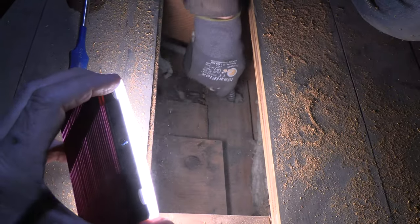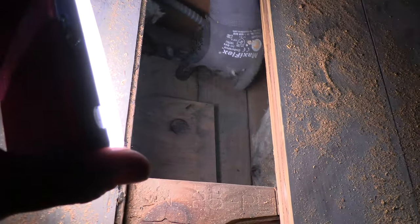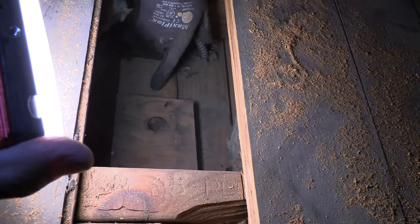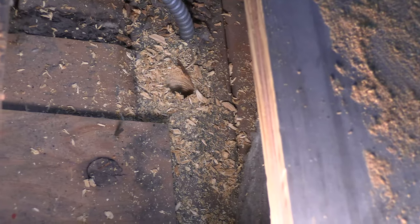Just a tad more investigation up here. I don't find any other cables, and I'm at my 70-inch mark — I think that's the cable from the receptacle we disconnected at the start of this job. I'm going to drill just beside it. This brown paper is the ceiling, and this 2x4 going this direction is my top plate. I'm going to drill right in the center of it. If you've got a 2x6 nailer, be sure to stay in the center — if you get sloppy and go through the edge, you'll pop through the ceiling.